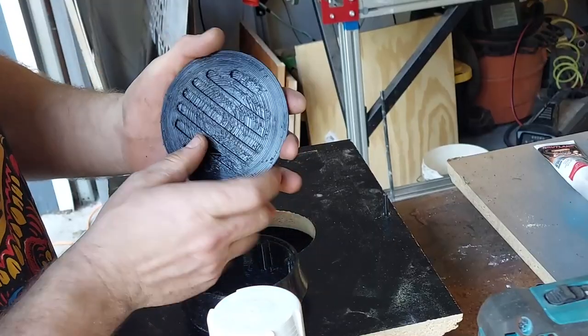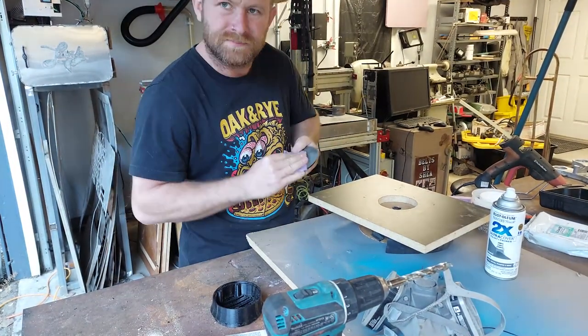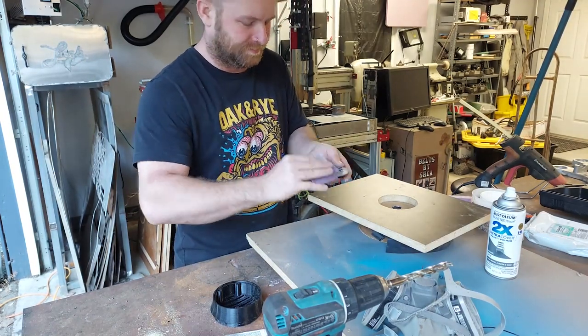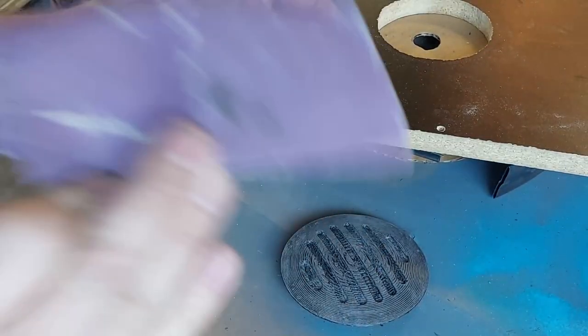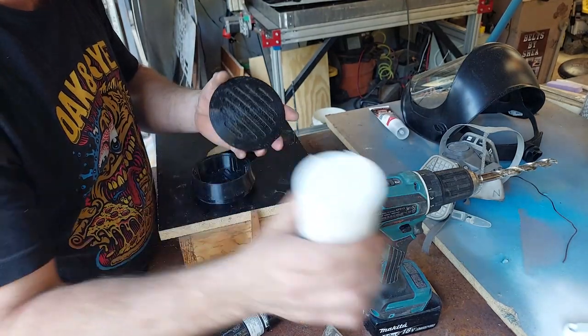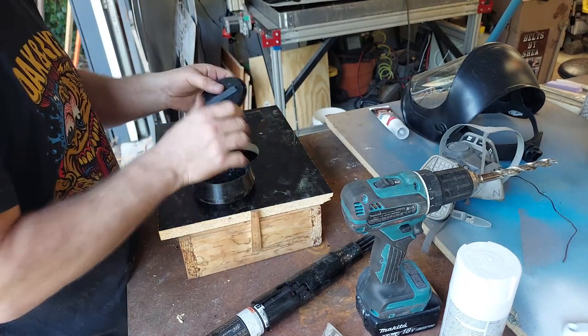This side, I'm definitely gonna sand. I'll probably sand it, primer it, sand it, spray it. And then whatever's left, I'll just sand it off. So my only concern is I have about a tenth of an inch there with no draft, essentially, but there is a fillet on top. So I think the gloss will actually probably fillet the inside of that. We'll probably get some flashing across there and I'll have to post-machine it. But yeah, so pretty cool.